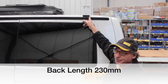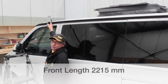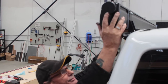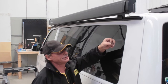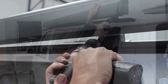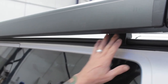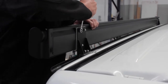From here to here the bracket is 230mm, then from this point to the front bracket is 221.5mm. Once you've got it on the bracket, you line it up where you want it to finish and then you can screw it in place. They do give you self-cutting screws but it's a good idea to drill a small hole first. Put your screw in place — you've got two on each bracket. Now that's all in place I can tighten up the holding bracket.